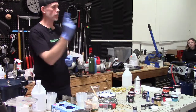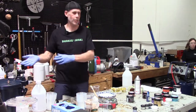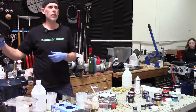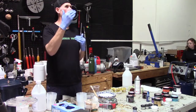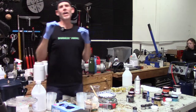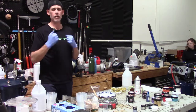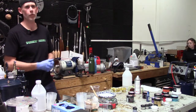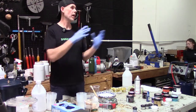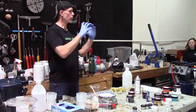There are three things you can do to get rid of moisture. Number one: dry the material out in an oven. It's not just wood — anything you want to cast, dry it out. Go to about 220 degrees Fahrenheit — I always say Fahrenheit because we have a lot of UK people on the live streams. You want to be above the boiling point of water. That will help extract the moisture. For wood and things like that, 220 will get it out. Pine cones are another good one — put them in the oven and let them bake.